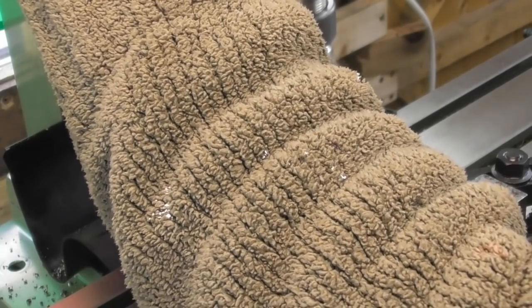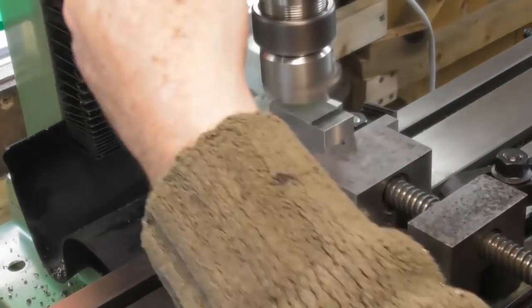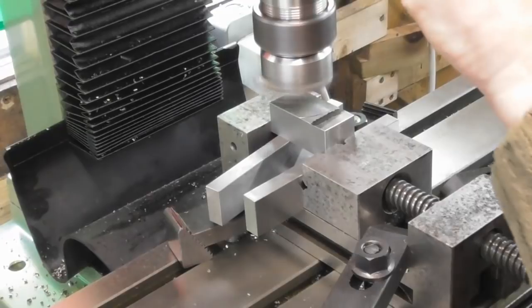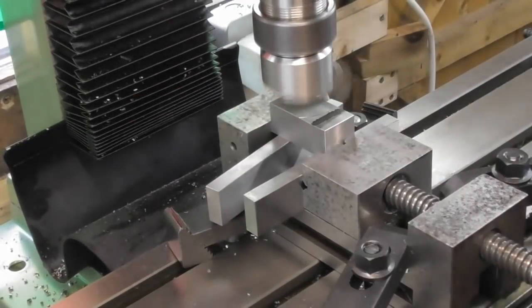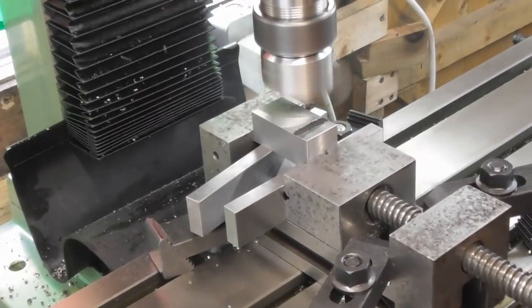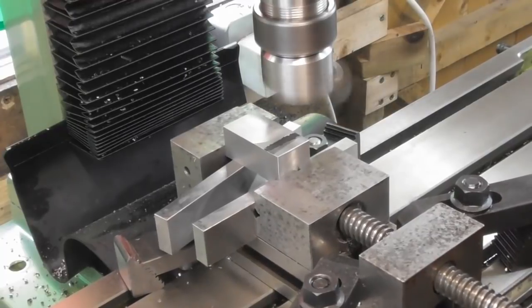I've been running at about 1100. I mean, the tool seems to have coped with it well with all the roughing out. So, I'll just wind down on the quill to touch. There we go. Set to 0. And again, not fussy. I want to come down, yeah, 10mm is fine. You know, a nominal 10. Right, okay.